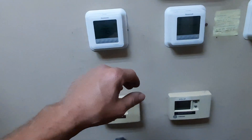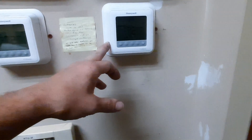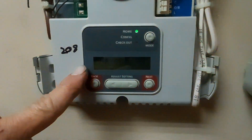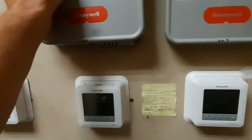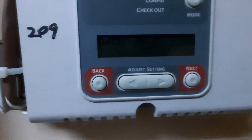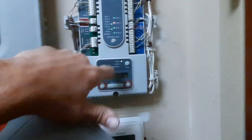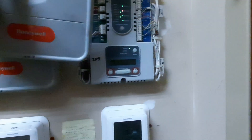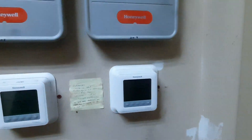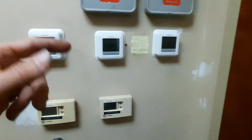At least they left the door open for me this time. They said we had a problem on the second floor but nobody wants to tell me anything. So we're at 52 degrees supply there, one stage of cooling, trying to locate where my problem might be. 76 supply over here, looks like I got a single stage calling right now, three zones calling, so I need to find unit 209.